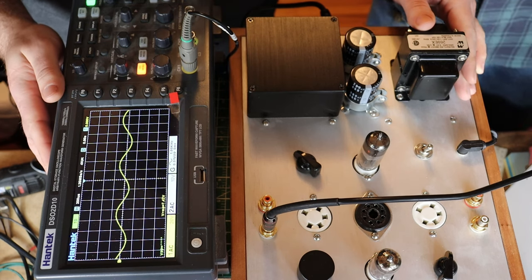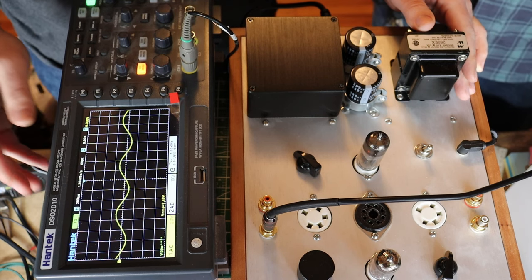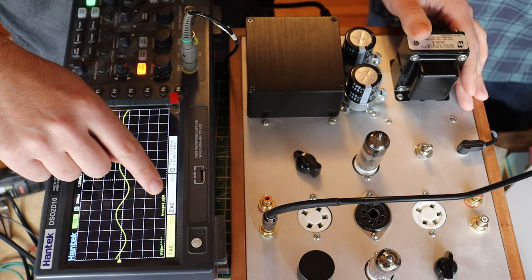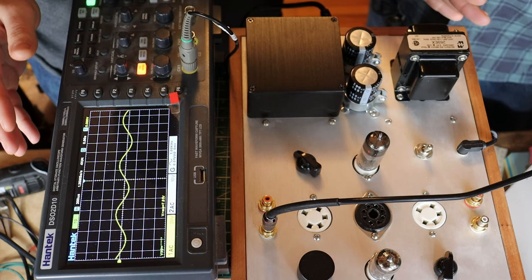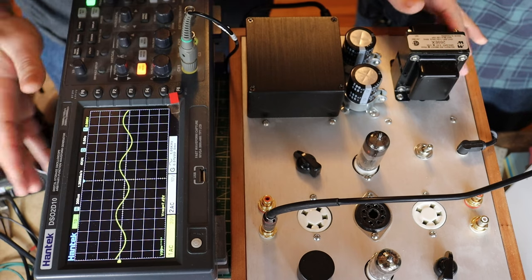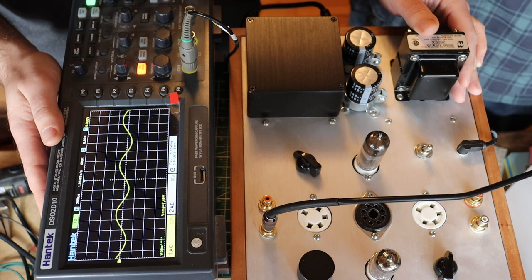With a low plate resistor in, you've got a very low-looking sine wave. We're sending 1 volt RMS — which is 2.828 volts peak to peak — into the amplifier. Let's stay with RMS: we're sending 1 volt in and getting approximately 7.5 volts out. This is using the 6N1P gain tube, which has a nominal gain of 33 or 34. So potentially this should be able to turn 1 volt RMS into 33 or 34 volts RMS, and clearly we're not getting anywhere close to that. In my experience, the closest you can get is maybe 80% of the rated maximum without going into the weeds electrically.